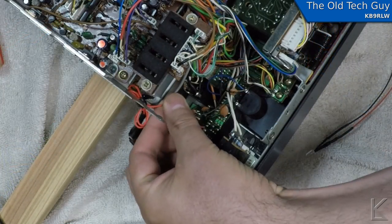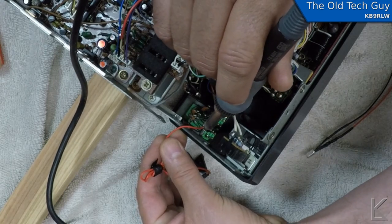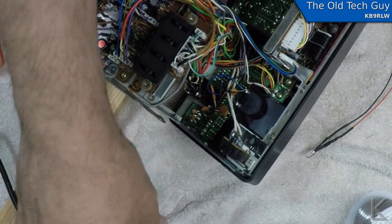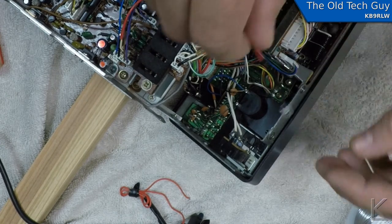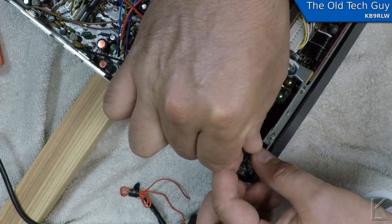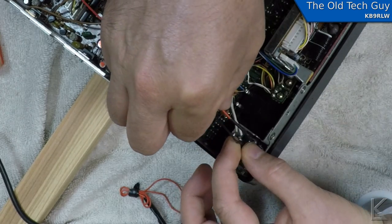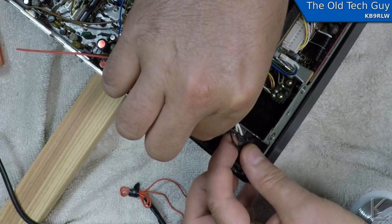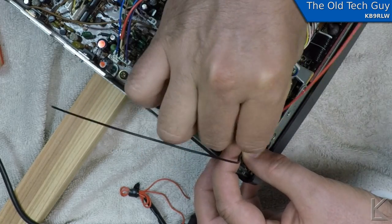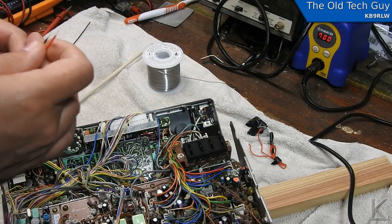Now the ground point — I see where you connected that. You just put it right on the pin down there on the PC board. The old mess is out. Now let's figure out how this is going to fit in here. This wire is going to have to bend around like so and keep it out of the way, maybe come down slightly, then loop back and connect right there. So I'll cut that one about here, then we'll tin these wires.